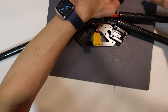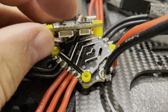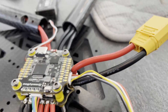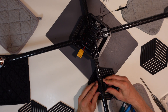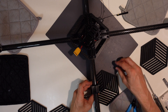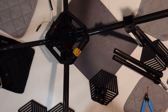After wiring and mounting the OREX, it was time to get ready to mount the arms and the top plate. But I ran into a problem - my VTX input connector was being blocked by the black battery lead. So I had to desolder it and solder it back on at an angle so I could connect my VTX cable. Once that was completed, it was time to mount the legs. I've added a lot of protective pads onto the table I'm working on, simply because the drone was all over the place bumping onto the table.